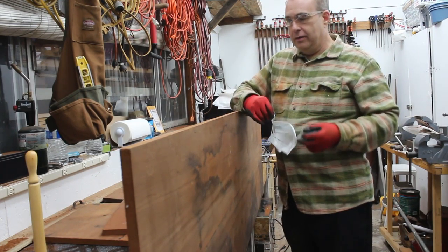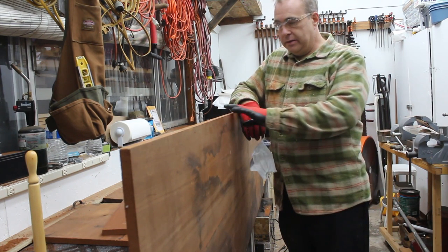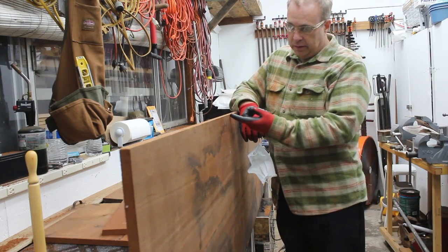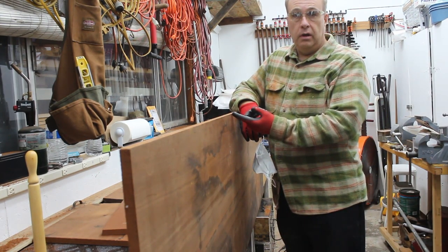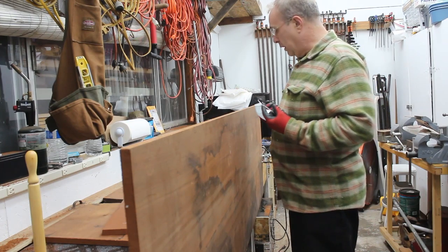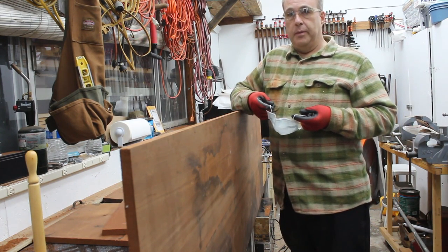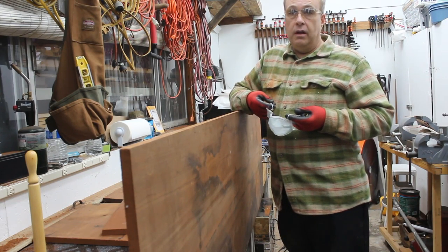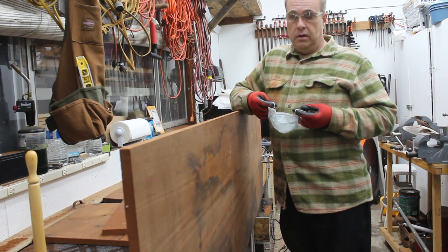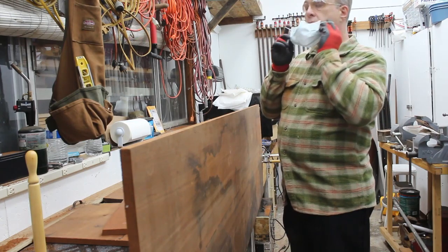Okay, so sanding's done on that end. I think that'll be a good fit — it wasn't much that had to be fixed. Here's the back side — this is the stove side of the buffet. I'm going to run the planer down a little bit. I'm going to score the underside for an eighth of an inch so I'll know when I'm done with the planing — it's just a dimensional thing, no other real purpose. Then I can flip it over and look at doing some bullnosing. I got a text from my buddy Steve who's been watching my videos with some suggestions on the bullnose, but I'll go ahead and do the planer style.